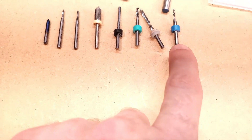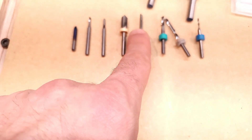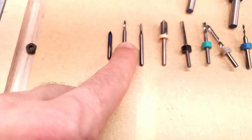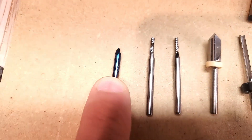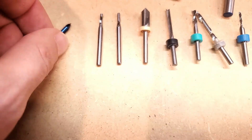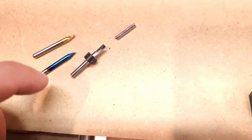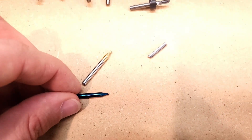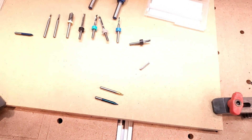These are my standard flat end mill bits - the standard bits you would get from X-Carve. This is a standard end mill bit at 1/16th inch, this is an eighth inch, and here's a regular cutting flute and your V-bit. These are special order bits - this is a single flute end mill bit I got for my vinyl records. And here is a 45 degree carbide V-bit, very very small, which is what I was using to engrave dog tags. Let me just tell you - you are going to make mistakes. This was me having a feed rate that was way too fast and aggressive, and I snapped a bit. This 1/32nd and this 1/16th bit both broke because feed rates were way too fast. You're gonna snap bits - that's okay, just get yourself up and try again.